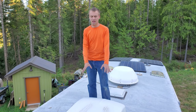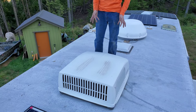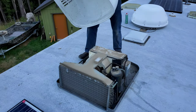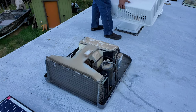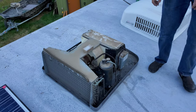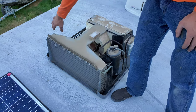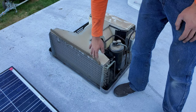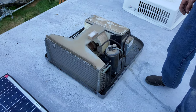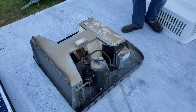This unit I've had open and I wanted to show you guys what the situation is. I already have all of the screws removed, so I'm going to pull off this main outer cover — that's held on with just four screws typically. The first thing I'm going to check, thinking through the refrigeration process, is the condenser — the hot side. I want to check if it's dirty. This one is pretty clean, so I move on to further troubleshooting.